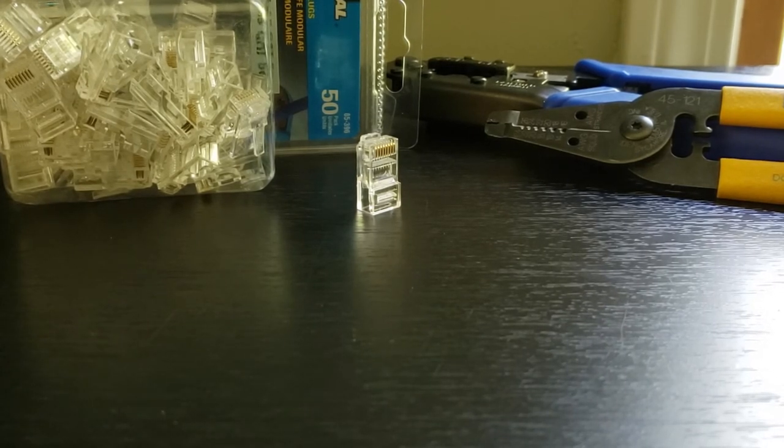I'm not even sure if that's still a requirement, but if you're using RJ45 ends and the products you're connecting everything to and from are using RJ45 ports, generally speaking, as long as both ends are the same, you're going to be fine. So if you're working with a newer generation MCA series and you want to connect up some keypads, and the keypad and the back of the MCA are using RJ45 ports, you're fine to use B on both ends.